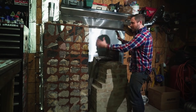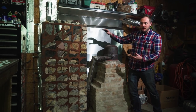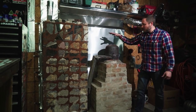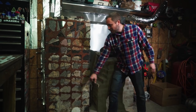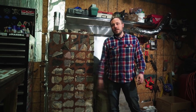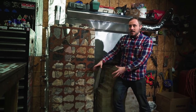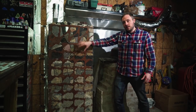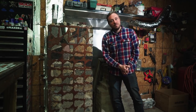Quick recap to get us all on the same page. This is my micro rocket mass heater — it looks pretty big, but this is tiny compared to normal ones that would take up half of my garage. Intake here, burns down there in my swirly Nautilus chamber, comes up here, dumps heat radiantly out into the room to warm it up quick. The air drops back down, goes through a series of wiggly pipes, and that's my exhaust. You burn stuff, it's super hot and super efficient. All of the heat in the exhaust is stored inside the mass here and released into the room, warming the garage over days. It works very well.